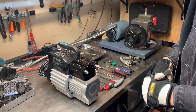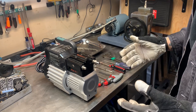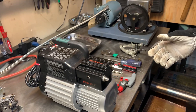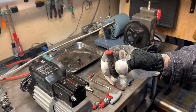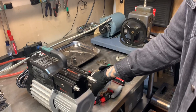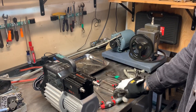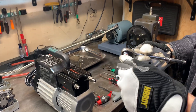I get a lot of people asking how do you rebuild the CPS TRS 21 or the TR21, so I'm going to make this quick video and blast through it showing you how to take this apart. Before we do, I'll cover some of the tools you're going to need: a pick for scraping small crevices, a 3/32 hex, a 5/32 hex, and a 3/16 hex.